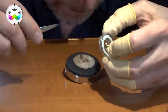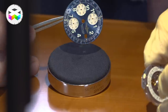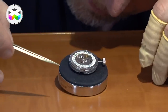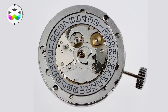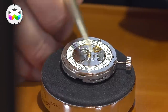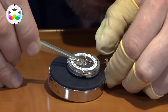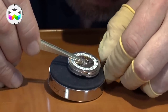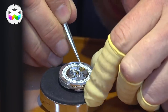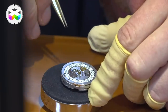Lifting up the movement, you have the underside of the dial with the different references from the company. On the under-dial side you can see the calendar mechanism with the different pivots for the chronograph hands. This pinion here, with the five teeth, is for the rapid date change for the calendar — if you pull out the stem halfway in one direction, it allows adjustment of the calendar disc. This wheel is part of the calendar mechanism and turns once every 24 hours to drive the date ring around.